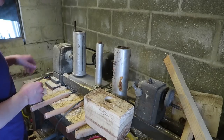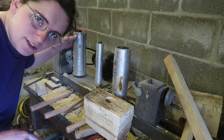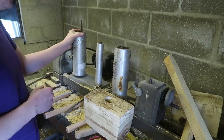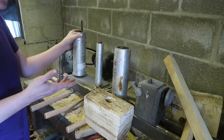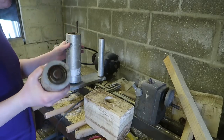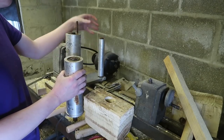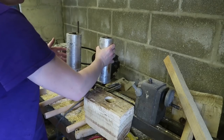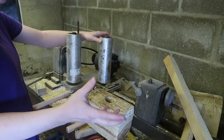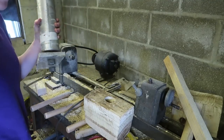Before I forget — these are the rollers I'll be using for the belt sander. I'm going for a 6-inch by 48-inch belt — they'll be plenty big. These are from an old 1980s or 1970s foil stamper, and they both have bearings in them. I have three rollers but I think I might only need two. I'll remove that from this plate and put it in there — one at the back and one connected to a custom-made roller for the motor. Still figuring it out, and I'll check the scrapyard to see what they have.